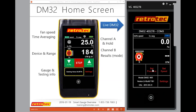So there was one last question which I have to take. Is there any advantage to using a positive rather than negative pressure for duct testing? Very little. The only time that there is an advantage is because you have to do it. Otherwise, it is always your best practice to do negative or depressurization tests for duct testing. It's a common question we get. All of your duct mask or duct seal gets pulled tightly. You actually know what your number should be. You're actually trying to get the smallest number you can to pass, and that's the best way to do it.